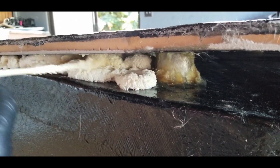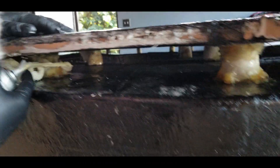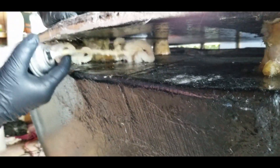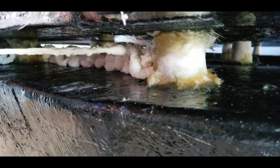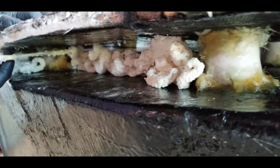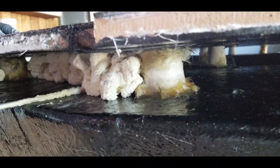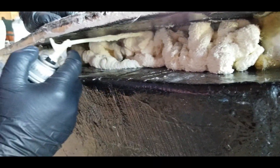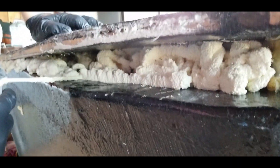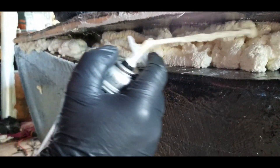Because of all of these little fiberglass puck supports that we've put in, this foam isn't really necessary for structural support, but I just like that it's a little bit overkill. It'll also help to muffle some of the noise that's created when you walk around on the deck. Another potential benefit is that over the years — and I hope this boat will last for decades — if one of these little fiberglass pucks came free under a lot of pressure, and it started to rattle around in there, the foam all around it would help to hold it in place.